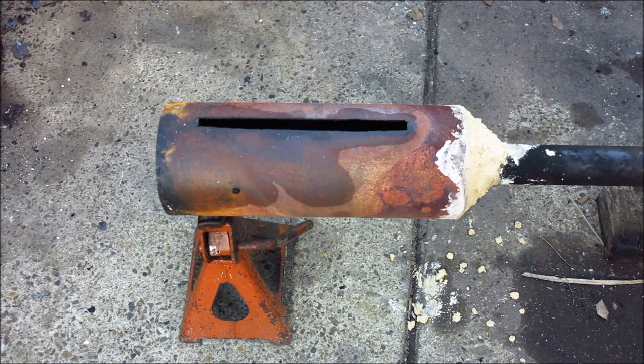The idea of that slit was more like something for a barbecue application where you don't want a concentrated jet of heat — you want it spread out a bit. The concept could probably go as long as you want; just make the slit a little bit narrower and as long as you've got a bit of extra pressure from the blower it should work just fine.